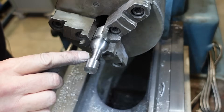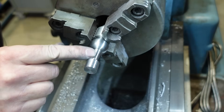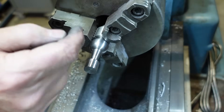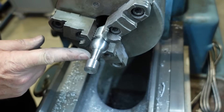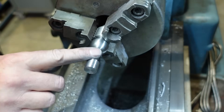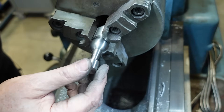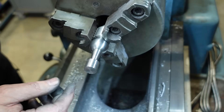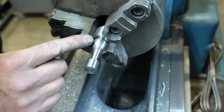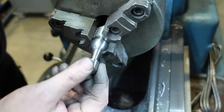I'm just getting ready to do the last ball. I've done my polishing right down to about there, and I've now got that clamped in that little block I made up with the tapered hole in it — that's solid. I've dialed in on a part here, it's still got a little bit of wobble but it'll be close enough, because at the end of the day this is a cosmetic ball. The axes of the balls don't have to be coincident — it's nice if they are, but a 0.1 or 0.2mm here or there won't be noticed.